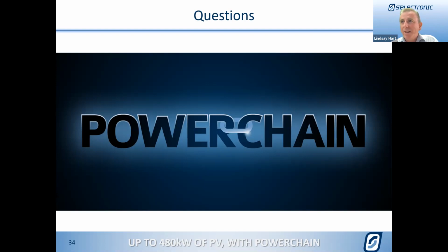Remote start for generator has been asked of me. Now, that's a really interesting one, and one that will probably cause a fight internally anyway, because one of the problems we get is when customers have control of generators, and it's really problematic. Often we get the question, the generator keeps starting, and there's no reason for it. There is always a reason that the SP Pro starts the generator, always, without doubt, and it's a good reason. That often might be because the batteries need to be equalised, and so it's made a decision to take action and equalise the batteries for the sake of the batteries.